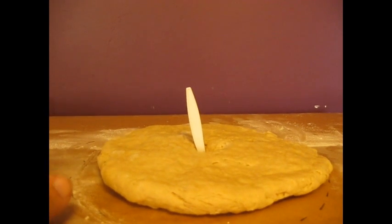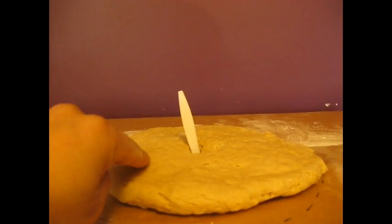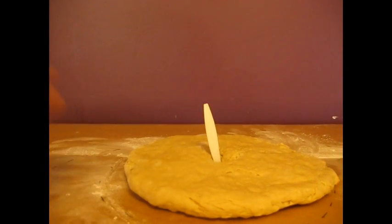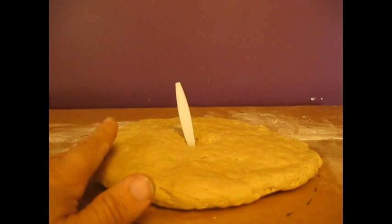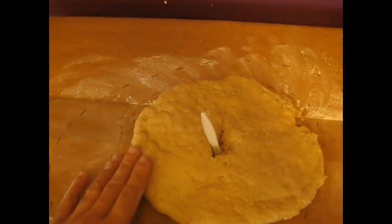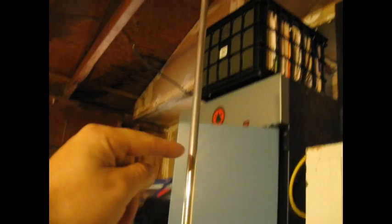By changing to a five-eighths antenna, reception improves the same way — you would receive twice the distance compared to a quarter wave antenna, if you're on a level playing field, not in a mountainous area. This is not recommended for repeater operations or mountainous areas where you require elevation. Here's an example of a collinear antenna — what you see here is actually two dipoles stacked together in one antenna, with a phasing loop between them, each section being a dipole element.